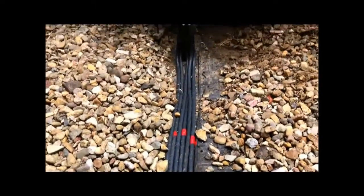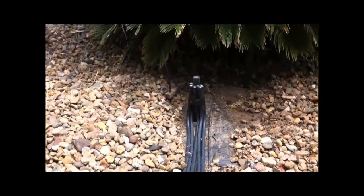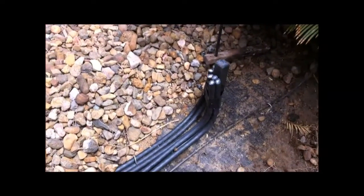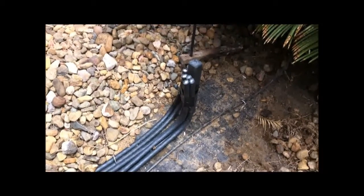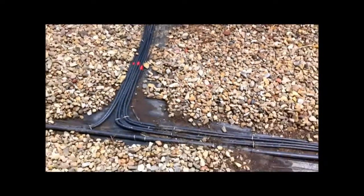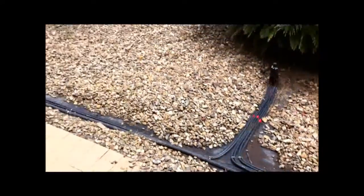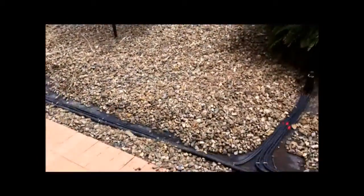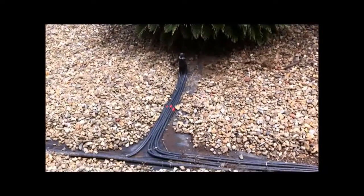This is an example of how you would lay out these heavy duty aluminium single cord cables. You lay them in a figure-8 configuration, flat down, and you can just use galvanised steel wire like tie straps to hammer into the ground and hold them down so they don't get kicked or bent up. The beauty of using 12 volt or 24 volt extra low voltage systems is you don't need to be an electrician to install them.